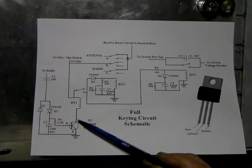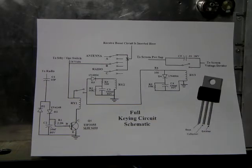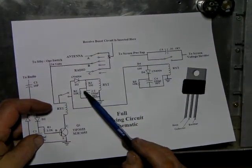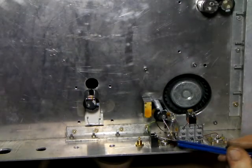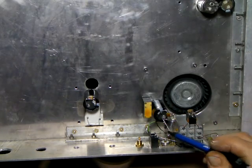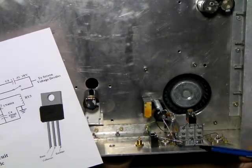What I just did was make the connection between the collector and the relay. Here is the main schematic of the whole key-in circuit. I've added this resistor, and this resistor I had already across the cap, and I added the diode. So here's the resistor, here's the diode from the master key-in relay over to here, and the resistor back to the cap. The cap is grounded to the same post that I mounted the emitter of the transistor on. And the other side of the coil - ground - back to that same post.